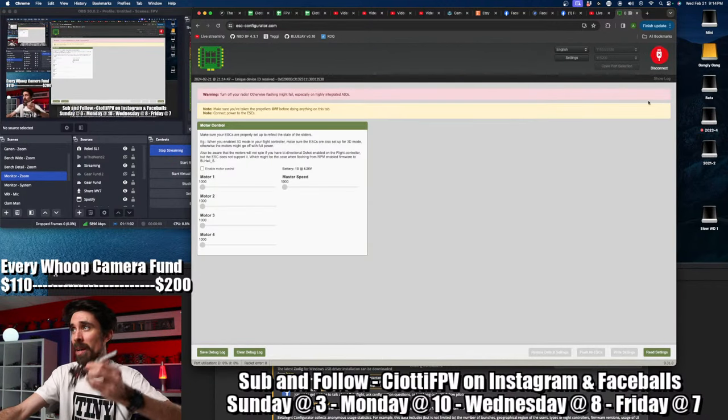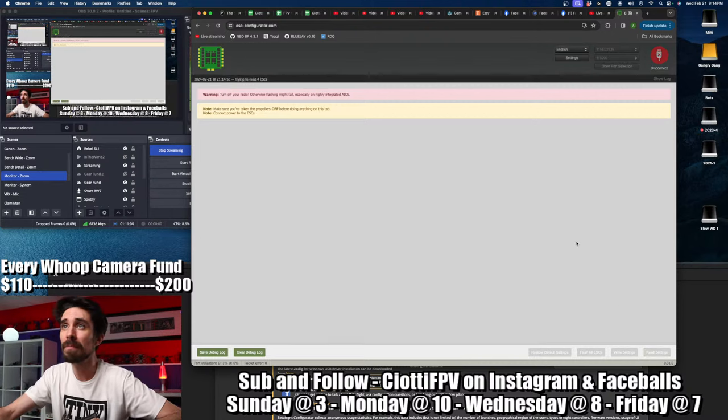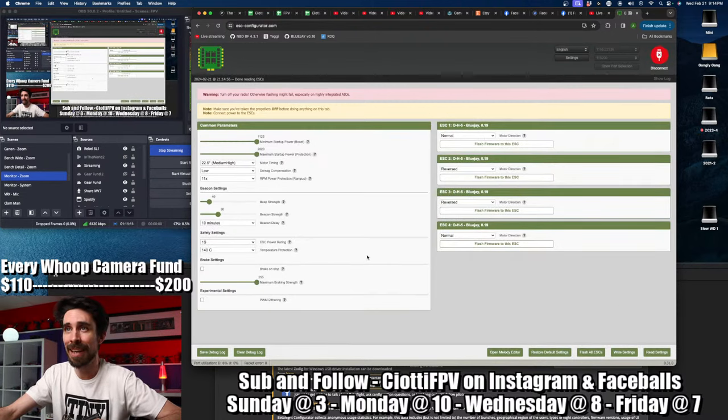I have plugged the battery in. We are going to hit connect. In the bottom right corner, we're going to click read settings. And it's going to tell me that it's on Blue Jay 0.19, which is great. Blue Jay 0.2, I do not like. I thought it did, but it doesn't tell me what kilohertz it's on. So I'm just going to leave it as it is.